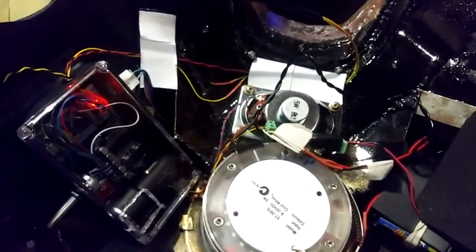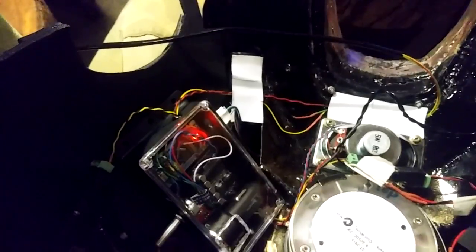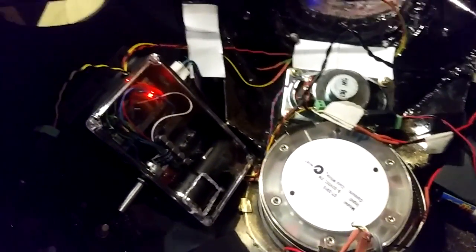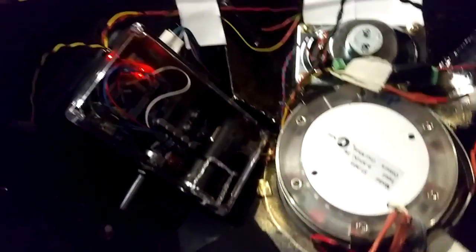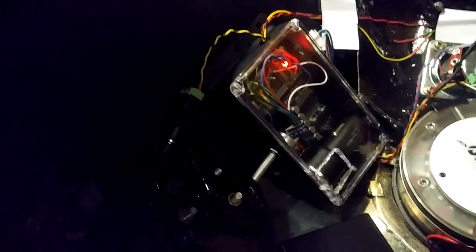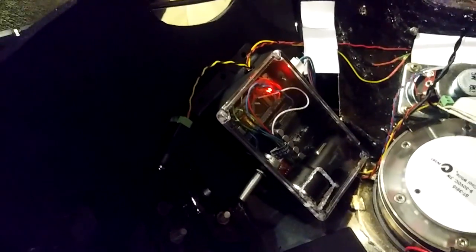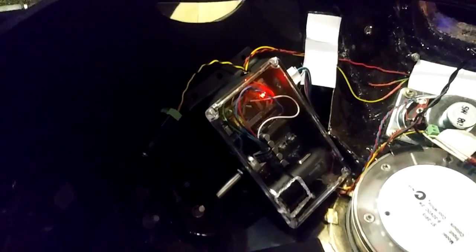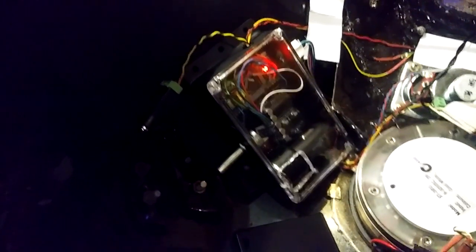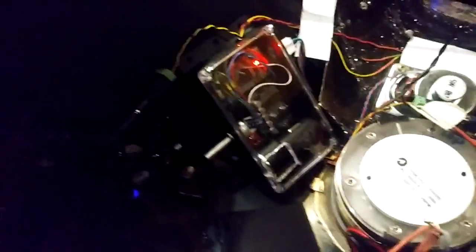Wahee, it stops! I had a massive feedback problem with the helmet getting too close to the chest and the microphone's proximity to the speaker. But all I did there was turn the potentiometer down a little bit and it seemed to fix it. So I just need to tweak that a little bit to get the right volume whilst still being understandable on the outside. We'll just have a quick demo.